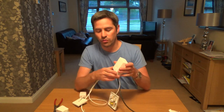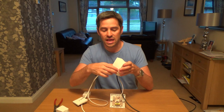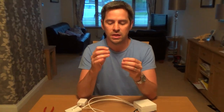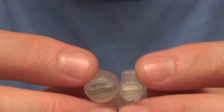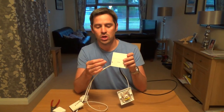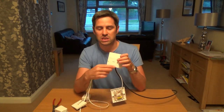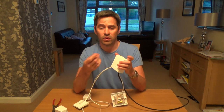It will work fine and it's a common thing that BT engineers do. Also, if you're doing a bit of rearranging and the cable going in is just a little bit too short — maybe you've slightly moved the master socket — you can use these little two-wire jelly crimps. There's quite a size difference between the three-wire and the two-wire crimp, so if you just want to extend the cable a little bit, the two-wire ones take up less room. Crimp three of these onto your three wires and extend out the wires as long as you want using spare wire — that gives you the slack, because there's nothing worse than so little slack that you can't work and wires keep falling out.